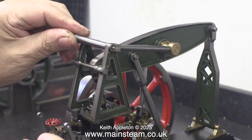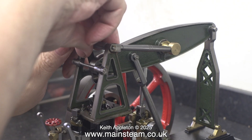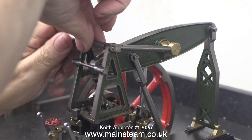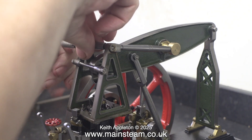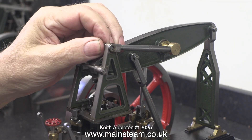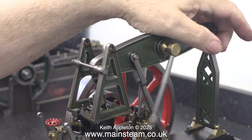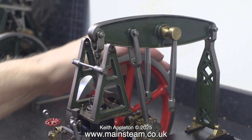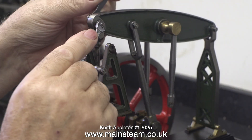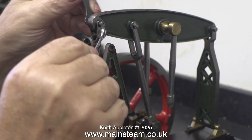I wondered if I could use the nut spinner at a slight angle to remove the bolt, and yes, it was quite simple to do that. At least for part of the way it was loose enough to be undone using just my fingers. Next, I'm removing the pin that holds the piston rod fork to the beam. This part was surprisingly tight, showing evidence of over-tightening at some stage.